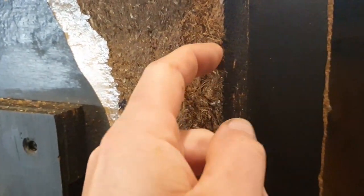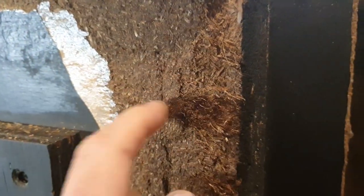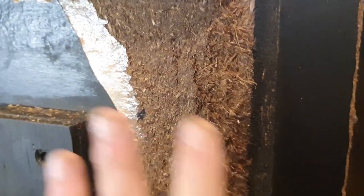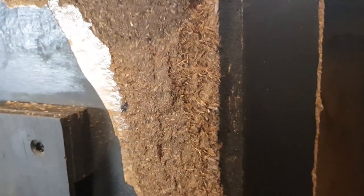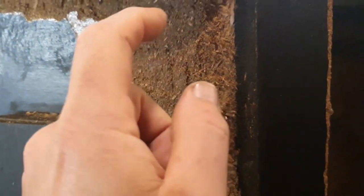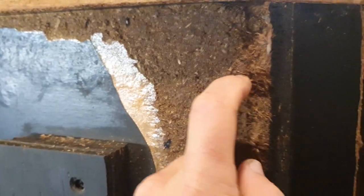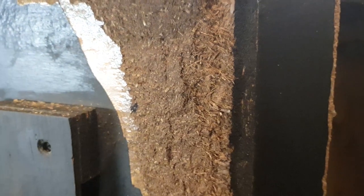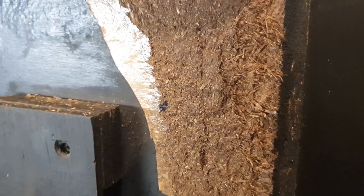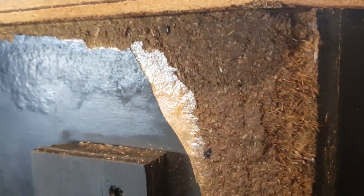I'm tempted here because it's still very weak. This doesn't actually strengthen the wood. It just preserves it, just prevents rot. When wood like that is exposed, it's a nest for dampness and rot to set in before you do the repair, and it rots from inside. So I'm just using that now to prevent that. I might use some very liquid wood glue, should I? Once I've got the fiberglass, it won't matter really. I'll see tomorrow.